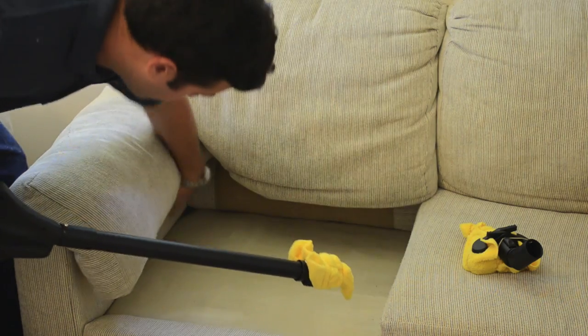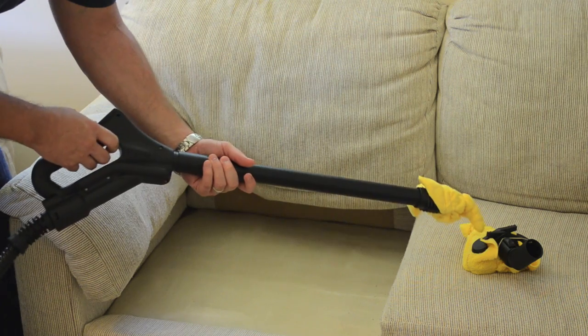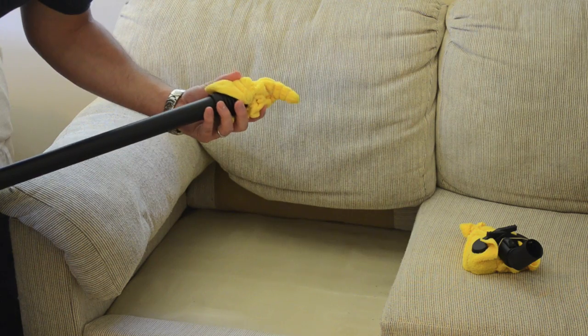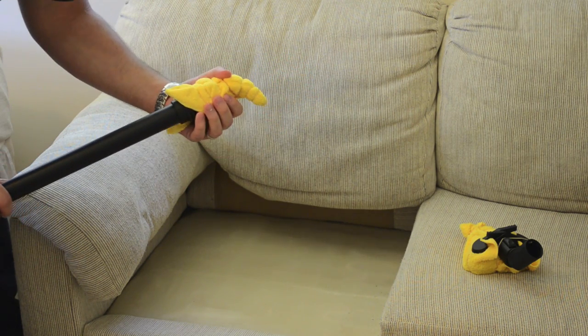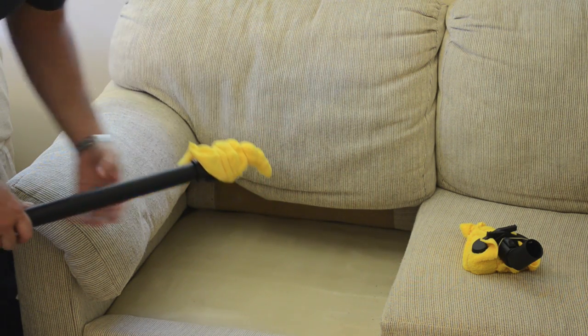As you can see along here, there are places where bedbugs can be residing. We're going to take two different attachments — one is more of a triangular attachment, or you can use the hammer head attachment depending on the model. Or you can use the single nozzle jet which we have right here. We took a microfiber towel to break up the pressure and reduce the steam pressure coming out to build up the temperature as we're doing the treatment.